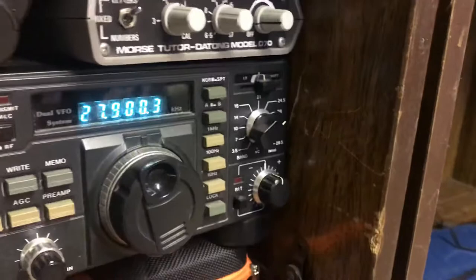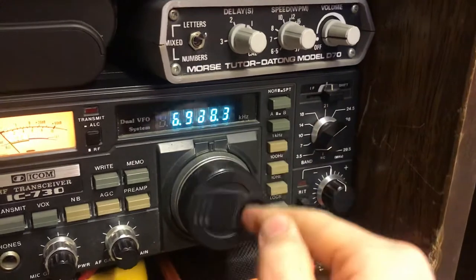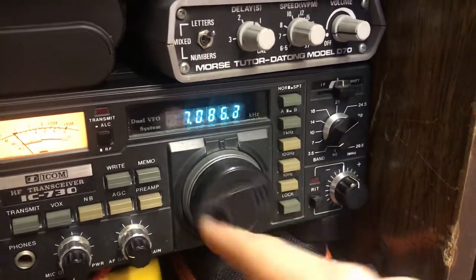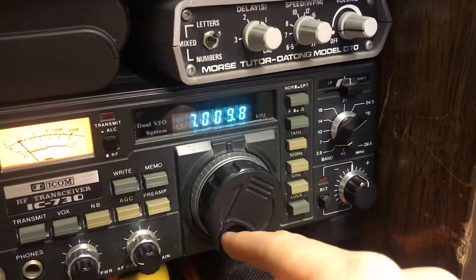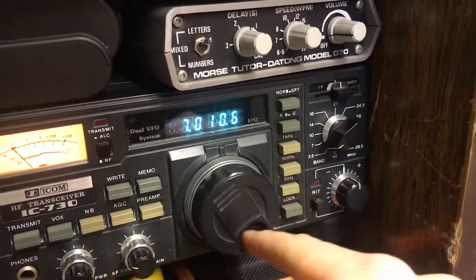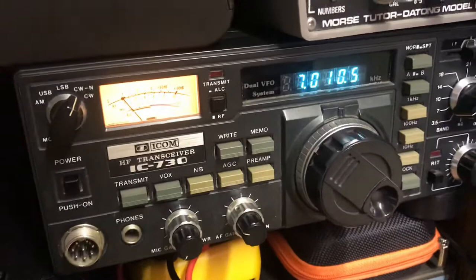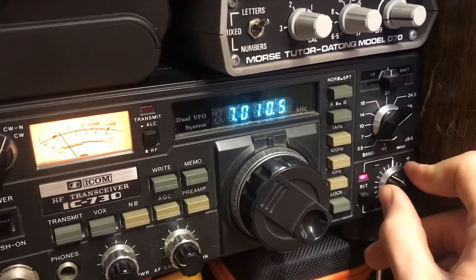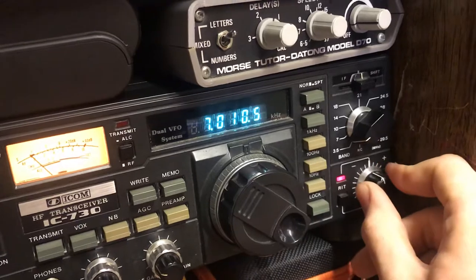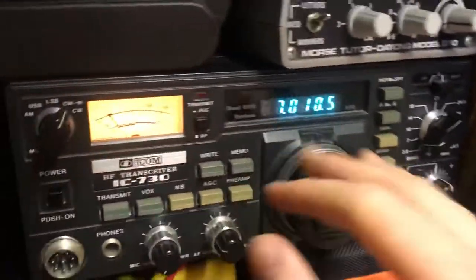Over here I've got the RIT, which I'm sure a lot of you hams out there know what this is. Basically, when you tune in — if I go down here to the 7 MHz range and go up a bit, I'm sure we can find some Morse for you guys. There we go, we've got some strong Morse coming in there. If you want to get that crisp sound, you can adjust the pitch of the Morse. You have the lock button here to lock it to this frequency so you don't nudge it out of place when you've got it perfectly how you want it.